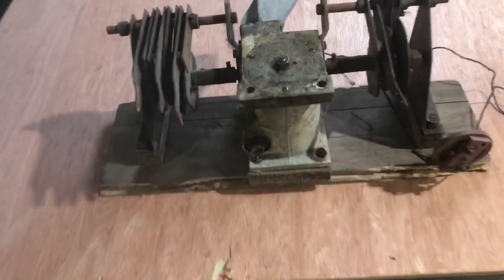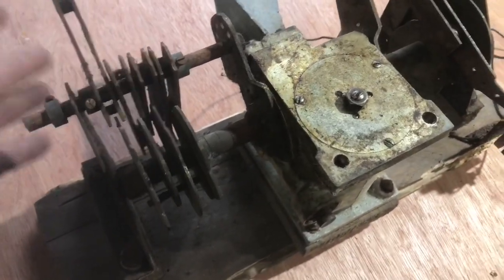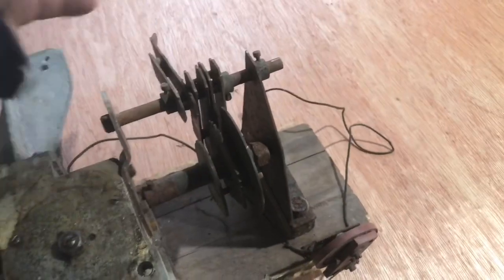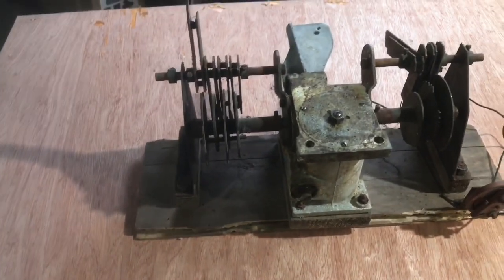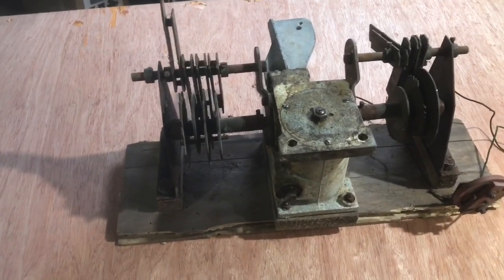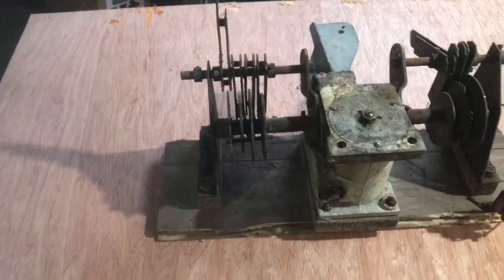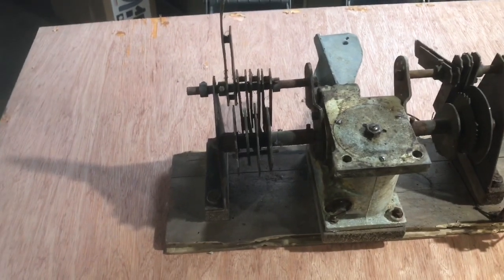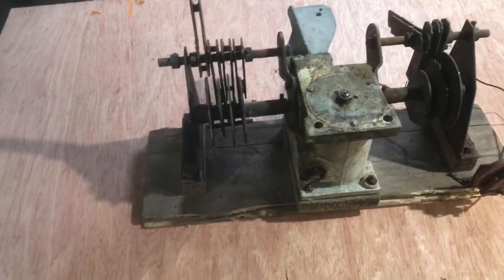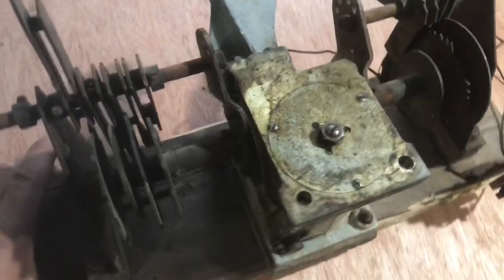What makes all this happen is the transmission, and that's what we have here. It's at a minimum a seven cam — so seven movements — but sometimes some of these movements are combined with other parts of it, so you might get more than seven movements. Like when he lifts his arm, his body might turn, so it goes from seven to eight. We will not know that until I get this thing completely put together and see what happens.